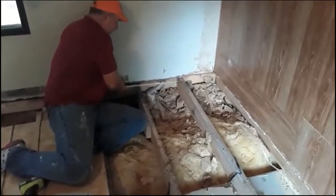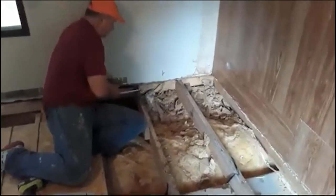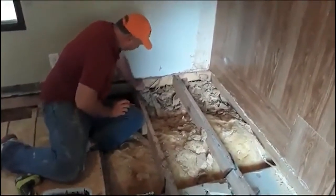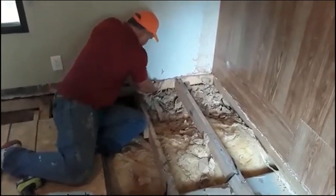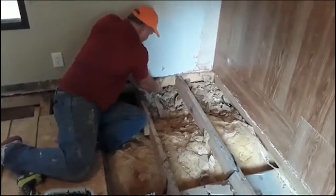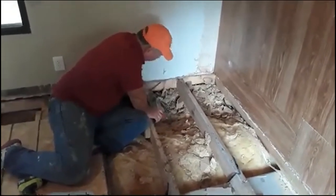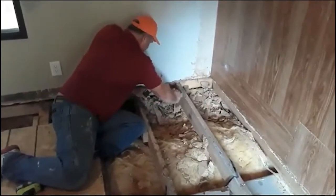What we're doing is supporting the floor. We're going to measure this 15 and a quarter in between these two. There's a cable wire I've got to be concerned about, so I'll end up putting the board back here a little bit so it'll have a way to pass through. I'll be laying it on its side, and I'll mark 15 and a quarter.